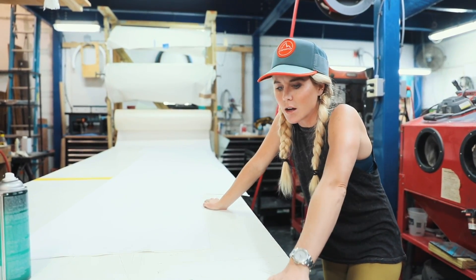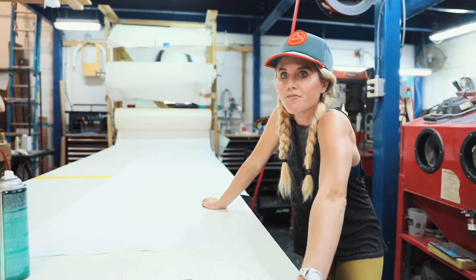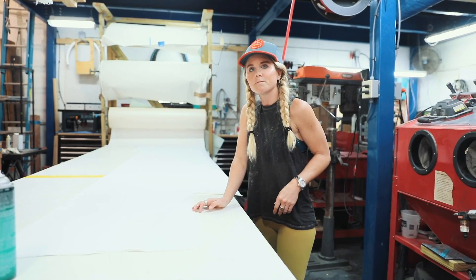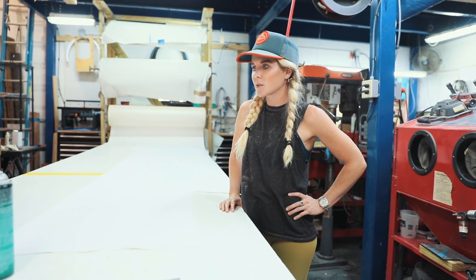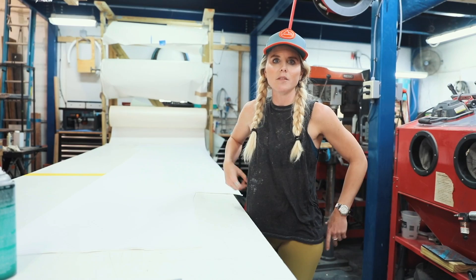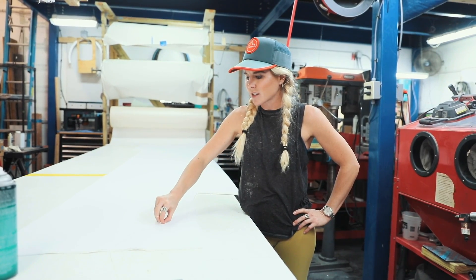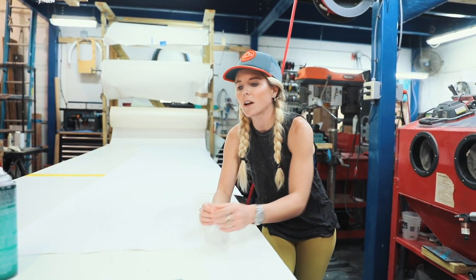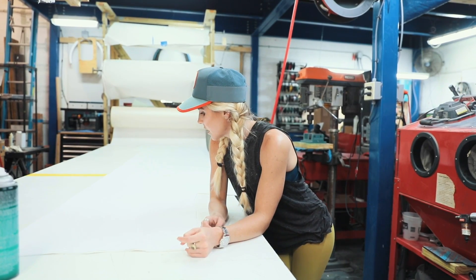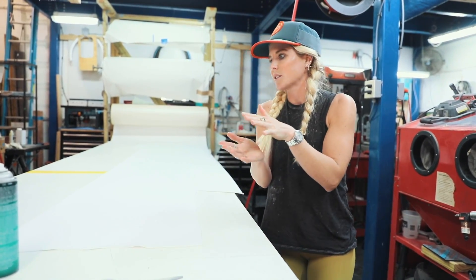Tell us what's going on. It's two o'clock — we got here at like 8:15, we've been working the whole time. So it's kind of a lengthy process, but it's not horrible. It's just time-consuming. There are some tricks that we learned, and obviously the importance of the glue is everything. Our boat's about 10, 11, maybe 12 years old now. Headliners start sagging between eight and ten years. So they were definitely due, and from the sound of it there are a bunch of 55s that are due for headliners. That glue starts sagging and separating from the main panel and that's when you get the droopy sagginess.